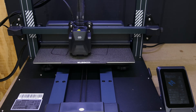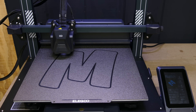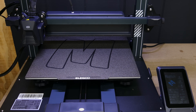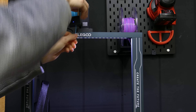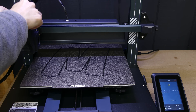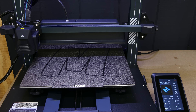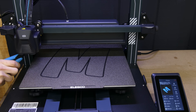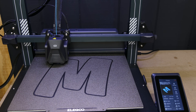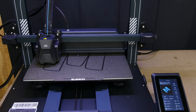Send your first plate to the printer. It will complete the first black layer before transitioning to blue and doing both layers one and two of blue. Once the printer finishes that first black layer and is ready to switch to blue, it'll move into the pause position and start unloading the filament automatically. Press the lever down, pull out the old filament, and start feeding the new filament into the extruder. You'll have to press the lever down again to get it started through the extruder gears. Once done, hit confirm twice on the screen and then hit continue. At that point, the machine purges a good amount of filament — this is where you need to pay attention. There is no filament cutter, so you need to be there to cut the filament before it moves back onto the print, otherwise you'll drag that purged filament out.